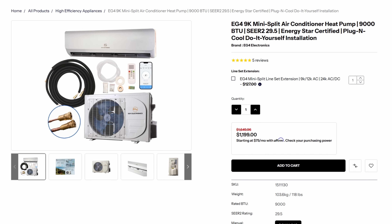Is it worth it? Absolutely. But let's talk cost — a lot of people advertise these as free heat, but they're not really free. In today's costs it would run about $600 to build one, and I'll drop a materials list below. At $600, you're about halfway to the cost of an EG4 mini-split — a 9,000 BTU unit that does both heat and air conditioning — which I do plan on getting in the future. But you can build one of these for $600, which is cheaper, even though they only work when the sun hits them. I'm actually pretty happy with mine, though I do need to bring it home and completely rebuild it — re-insulate with better insulation, get better Lexan glass, rebuild some tubes — and I intend to do that because I think it's worth it.